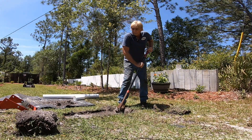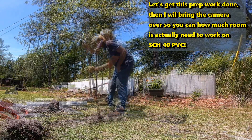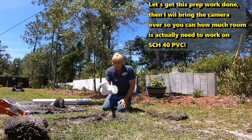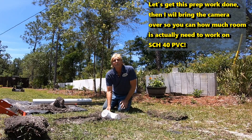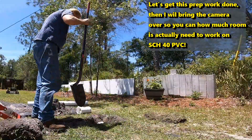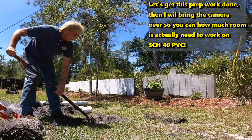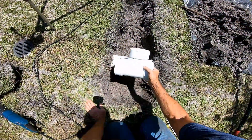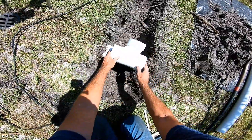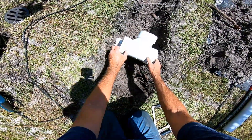Let's go ahead and dig this a little bit wider because we need a lot of room to work here. Remember, this is going to be a really tight fit — it's got to fit directly onto this other piece of Schedule 40 down here. Here's our fitting, and you can see we're going to install a drain coming from that direction over this way. We need to make a cut on the inside of this coupling to these marks right here.